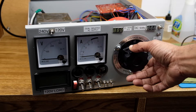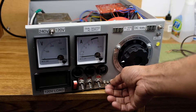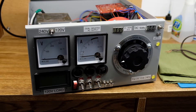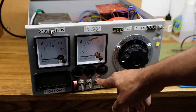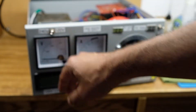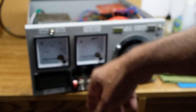If things look okay you can start turning on more bulb switches. These three bulbs together cannot drive a real 40–50 watt load because there's already significant resistance in series, so the load only gets a fraction of the needed voltage. In that case I can bypass all three switches using the main bypass switch, which bypasses all the bulbs and delivers the full applied voltage to the load. The current meter indicates the current in the 120-volt supply.